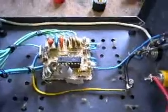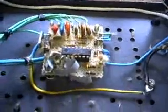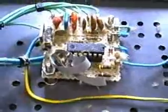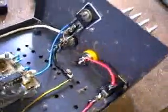So naturally I thought I had cooked the power MOSFET, because I immediately lost my waveform. And I opened it up and discovered this. I should have recognized the smell of the electrolytic capacitor, but it sprayed paper and plastic all around the inside of this. It really was quite a very loud explosion. It sounded like a firecracker going off. Here's the undercover of that.